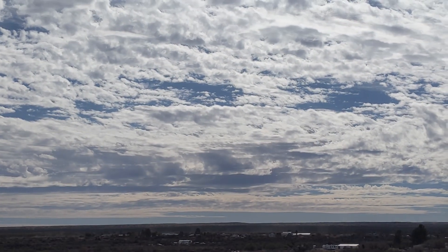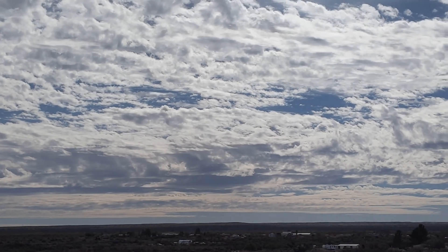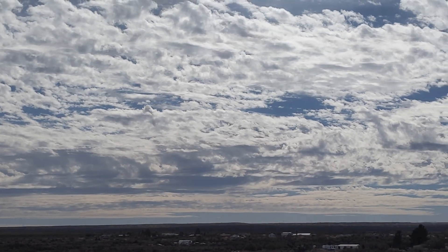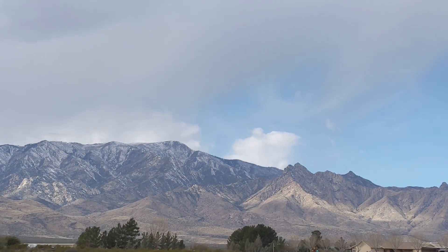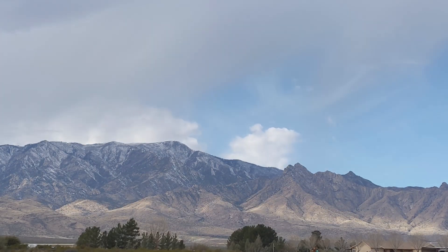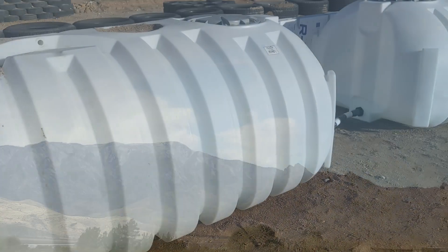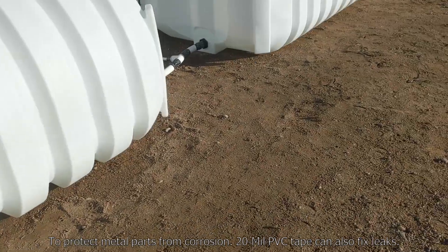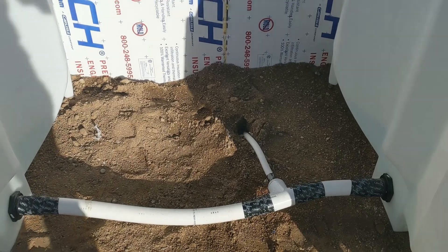Hour of truth — filling the tank with water. So far I have no leaks. The pressure in the tubes will go up a little bit; right now I have about a foot of water and it will go to about 4. I pipe-wrapped just as an extra precaution to minimize any leak that might be there, but I don't think there is one.